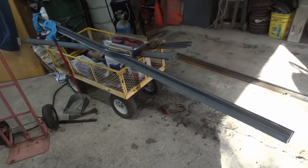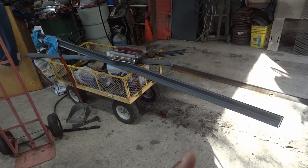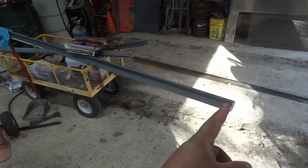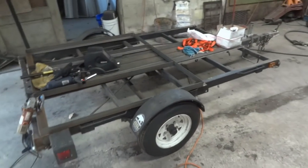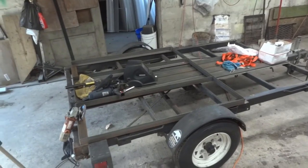Also, because 20 inches is divisible into 10 feet. These are 10 foot sections here, and 10 feet is 120 inches. So basically, out of 20 linear feet, I'll be able to make the sides that I'll need. I'll have 10 pieces that'll stick up. All right, so from there, let's see what else I have to do. Let's start cutting these pieces out.